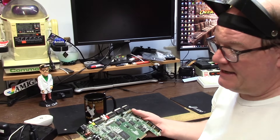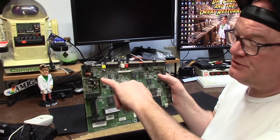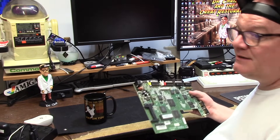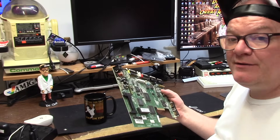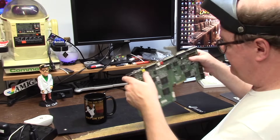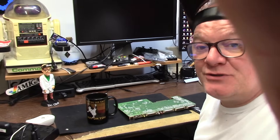As a convenience and for better power flow, you don't need the 100µF caps here if you do that. But I put them back on just in case you ever want to put a modulator back, and I return the modulator with the unit — unless I forget. Apparently I forget a lot because I found like 15 modulators.